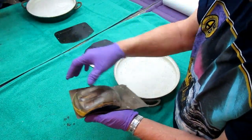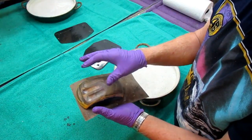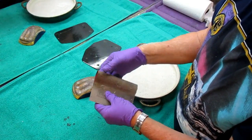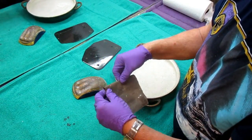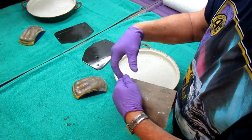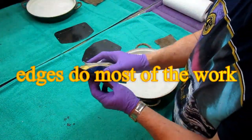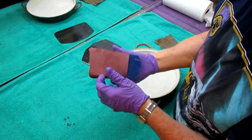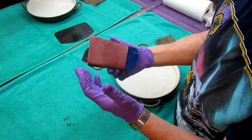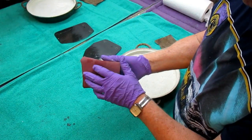A new cutting edge. And a new cutting edge. And you've maximized the use of the sandpaper. Then, when you're all done, you can tear it in half this way, and you'll have actually two new edges. Because keep in mind what happens, and this is an important thing to understand. You don't wear out the sandpaper here. It wears out on the edge. So this is a good tip and a good way to maximize the amount of value you get for one sheet of sandpaper.